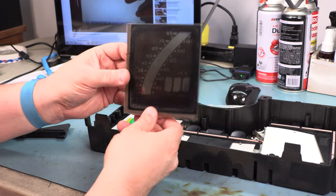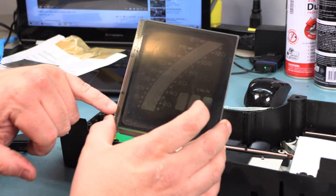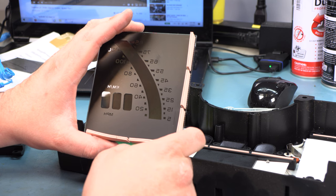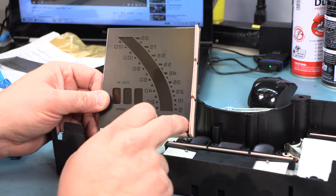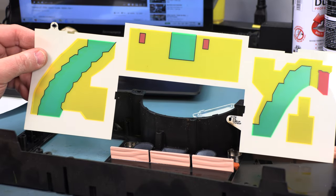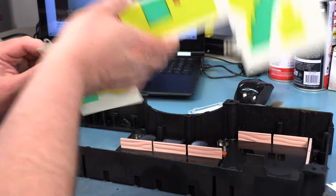Indeed, when we look at the LCD panel it has been faded. I'm also seeing a ring of Armor All. Armor All is magic stuff and it makes your car look good, but it also contaminates the electrical surfaces right there, and when it does that those segments of the LCDs stop working. The back film is not peeling in any way, and I see no cracks around the electrical connectors, so this is definitely a restorable panel. Color filter looks good — I see no fading and no black paint transferred from the back side of the LCDs to the surface of the color filter, so it is perfectly usable.